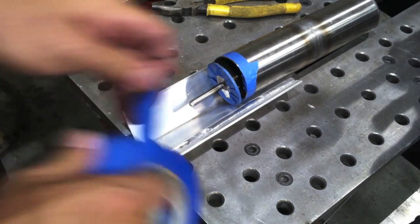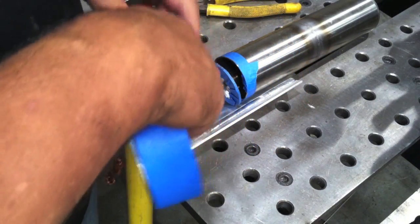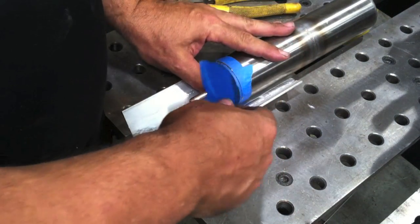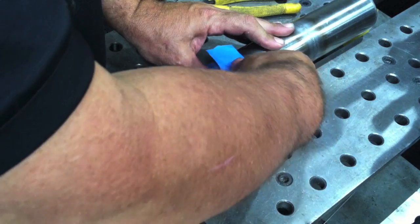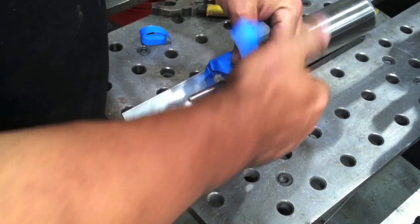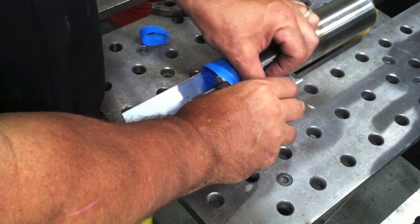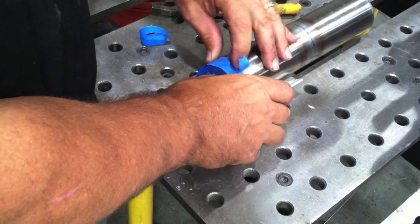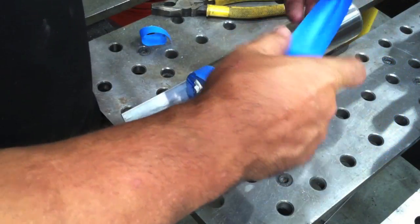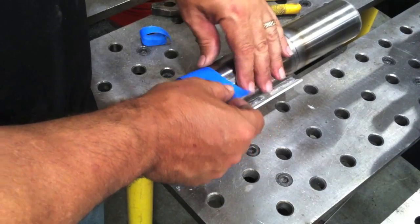It's great if you can have some kind of little adapter on the end — some kind of little stainless plug or something that you can hook an argon hose up to — and you don't always have to tape. Because when you just tape and poke a hole in it and then stick an argon hose in there, you can get leaks. So you're less likely to have leaks if you've got something more substantial, or maybe a piece of Lexan with a threaded barbed fitting in it. Tape works too — I'm using just blue painter's tape here. It works pretty good if you don't get it too hot.